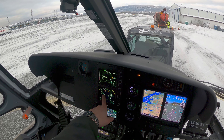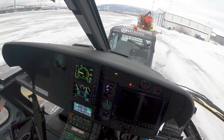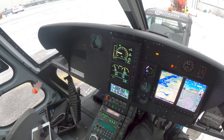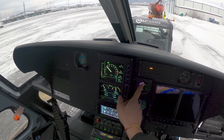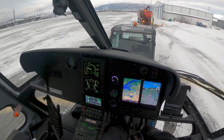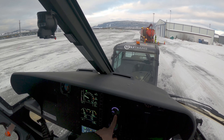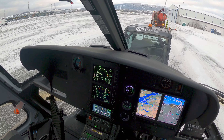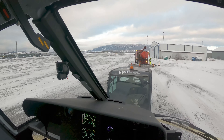Good temperature on the engine, and now I'm ready to go up into high RPM. I put the checklist away because I need to be ready to fly. RPM increases — at 350, 360 it went off. That's perfect. RPM stabilizes at 370, 378, 380 — that's perfect. And do that fire test — you get the gong and the little light there. Now you're ready to lift.